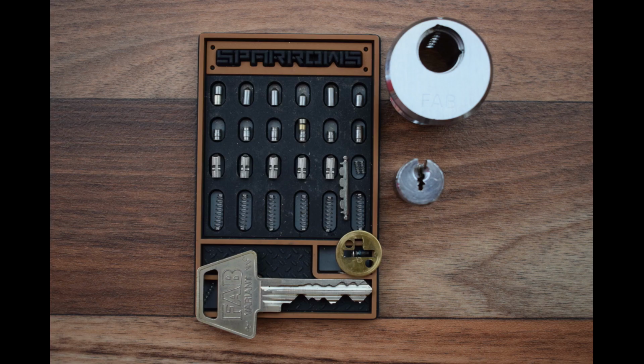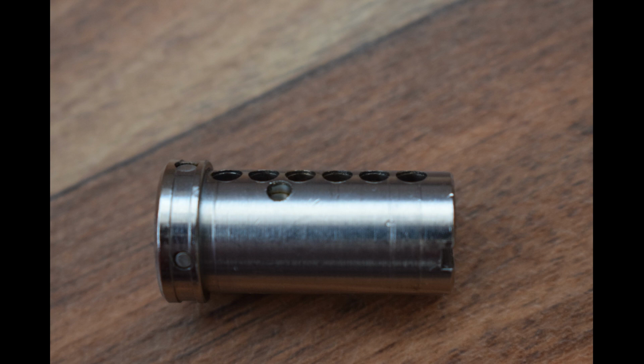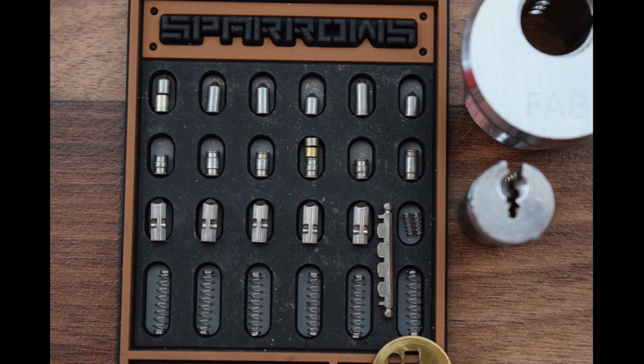The basic configuration is 6 standard key pins coupled with 6 Assa barrels. Core chambers in locks I encountered are overmilled, and they do catch the lip of the barrel quite effectively. It's worth noting that picking the pin tumbler part of the version without a sidebar is actually harder. The sidebar springs provide a counter rotation when you loosen the tension, which helps to get pins out of the overmilling. Tolerances of these locks are very good.